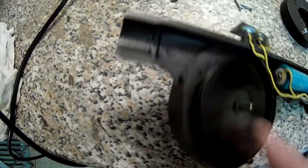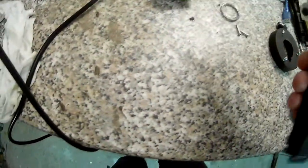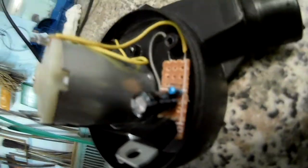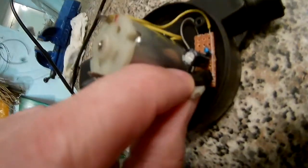But then the motor just did a few turns before the overcurrent kicked in. So let's look at the very advanced circuitry on this side: one resistor, one capacitor, one transistor — an NPN Darlington.